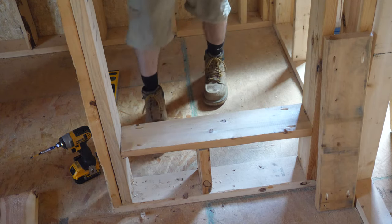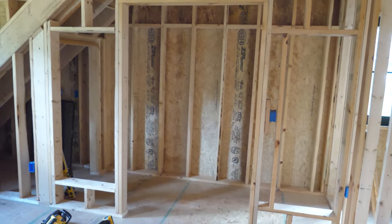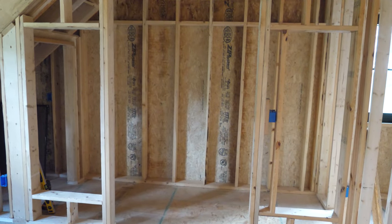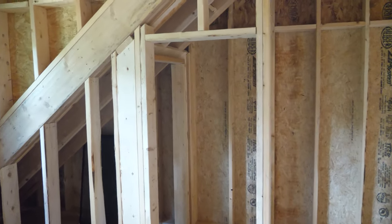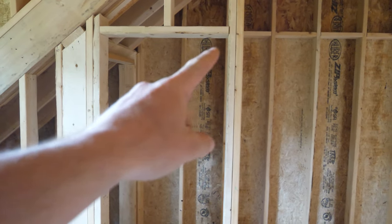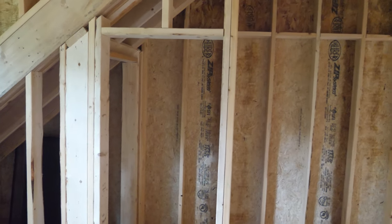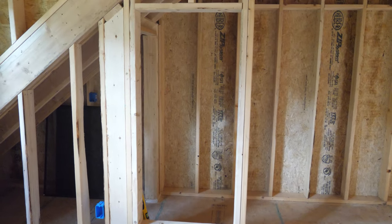That's strong enough for a bedroom closet niche — and just like that, they're framed in. I wish all the rest of these framing projects went that smoothly and easily. I do want to put some backing on these because it's quite a bit of span for drywall. I'm going to use one-by furring strips — probably one at the bottom, one at the top, and then maybe every 16 inches or so — just to give the drywall some backing on this side and on the inside of the niche.